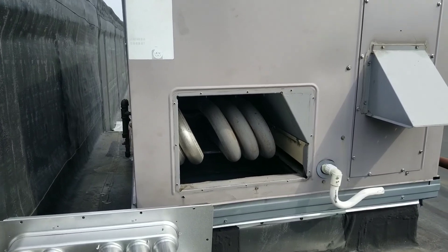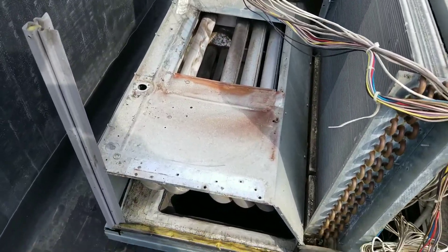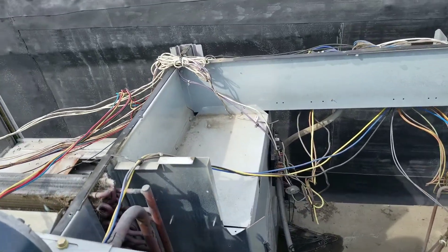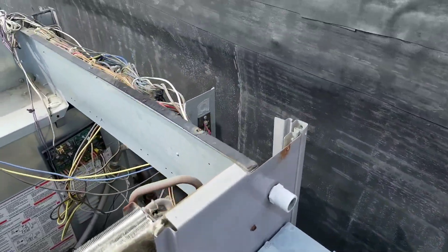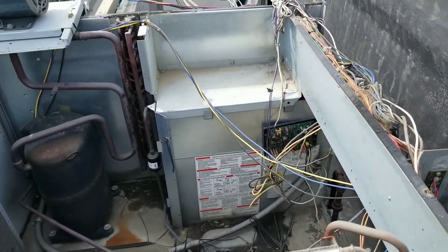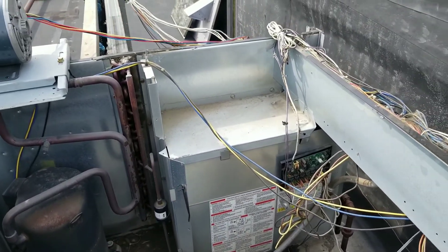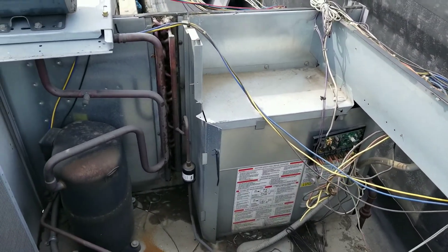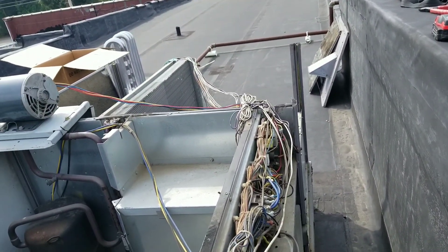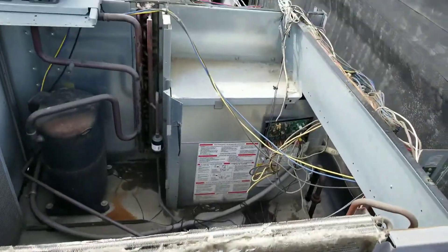Here's what we got going on: our blower assembly is removed, the top is pulled off, and there's our drive motor. As you can tell, we don't have enough room to pull that heat exchanger out this side. My idea is removing all the panels around our inducer assembly and getting access to the front of the heat exchanger, then maybe pulling it straight up through the condensing section — I'm not real sure yet. We'll pull some more panels apart and see what our options are. Might have been better off just to quote a new unit.